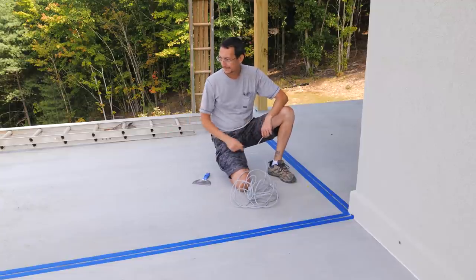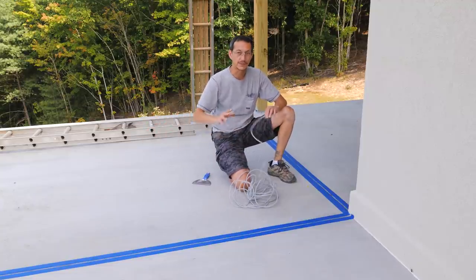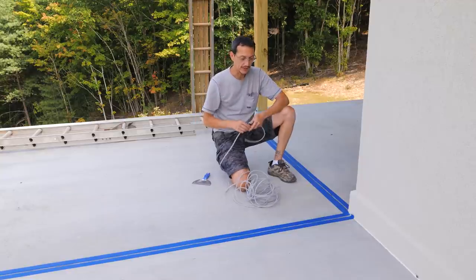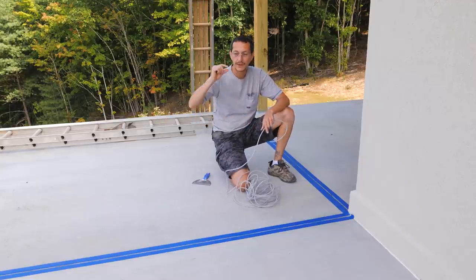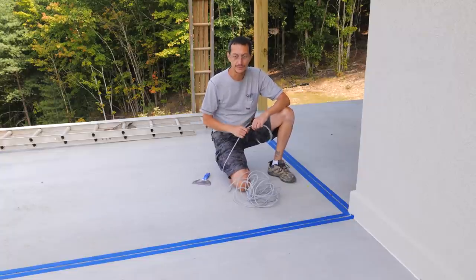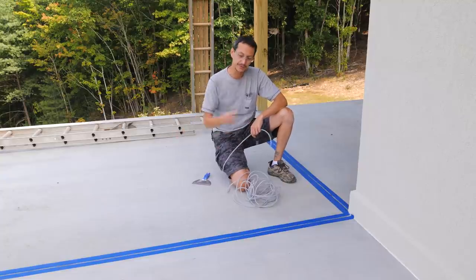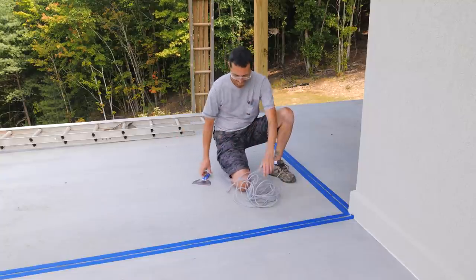That would take probably 2 tubes of caulking to fill it, and then it's just going to run out the end because it's so liquidy. Use backer rod, reduce your gap to a half inch deep, fill it, and it'll dry, self-level, be perfect. Also, tape your joints before you do it, and then when you pull your tape, you've got a perfect line.